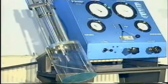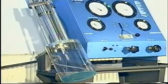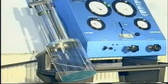There will always be a certain amount of fuel oil flowing from the fuel oil return pipe when the fuel valve is full of fuel oil and pressurized. Fuel oil must not seep from the fuel valve nozzle holes until reaching a pressure of 50 bar below the specified opening pressure. If the fuel oil does seep from the fuel valve nozzles, see Instruction Book Volume 2, Chapter 909.